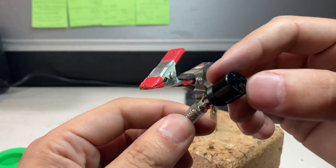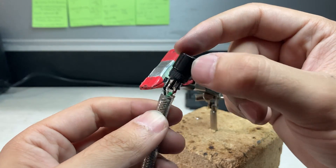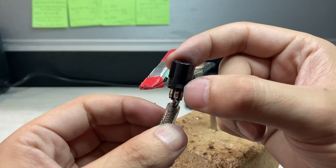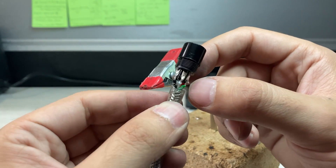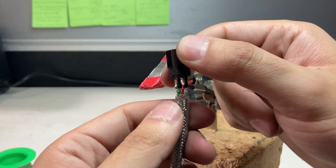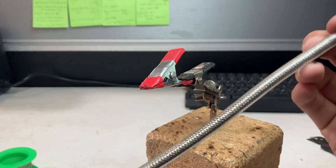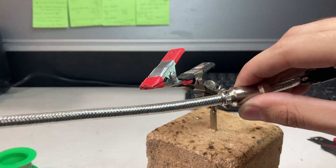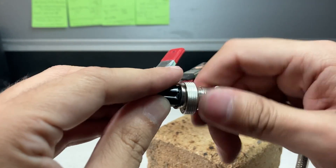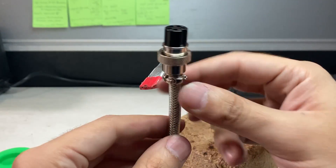So now check your work. Pin 1 — the red cable. Then the green cable which is pin 2. White cable, pin 3. And then pin 4 has a black cable. Okay, all the soldering connections are in. Make sure none of these cross — if they do, they'll cause a short and cause your cable not to work properly. Make sure none of them break, because a lot of times I get error 6 messages over one of these cables breaking off from solder points. Move your connector back on, and you're going to slowly go back on. Okay, so now you've added your 5 pin to your cable. Now test it out and see if it works.